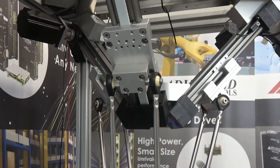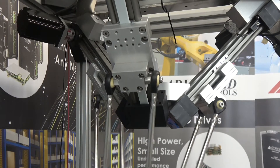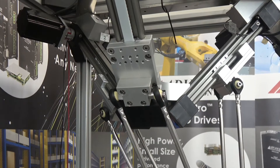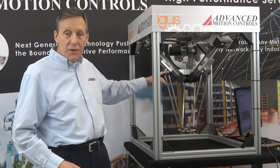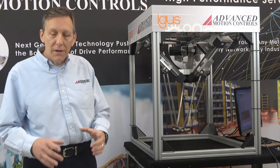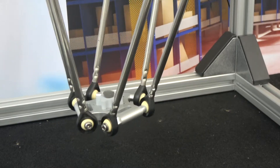It's an equilateral triangle and the actuators are attached to the endpoints of the vertices of that triangle from the top, and they actually meet in what's called an effector plate. As you can see, each of the carriages on each one of the stages is connected by pivoting rods. On this model 360, the effector plate has a radius of about 42 millimeters.